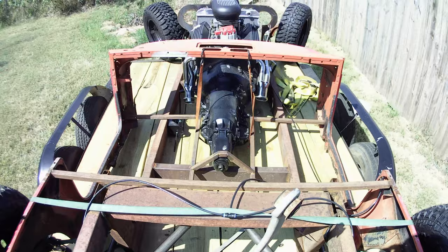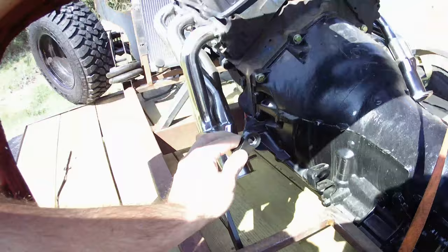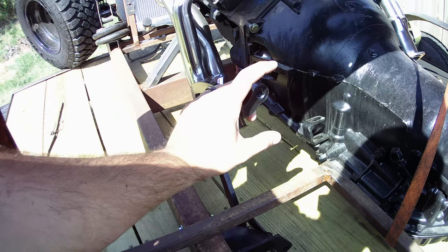You've got the motor and transmission in there, front end and rear end. What about brakes - where are you going to put that pedal? I went with the conventional Model A style master cylinder under the body. I've got the pedal in - the pedal comes up here and it has a regular round pedal. I'm going to go ahead and make myself a new pedal. That's just about as far as I've got on the Jeep so far. Bing, bang, boom - cut, grind, weld. You got yourself a rat rod. What are you waiting on? Let's get out there and go get you one.